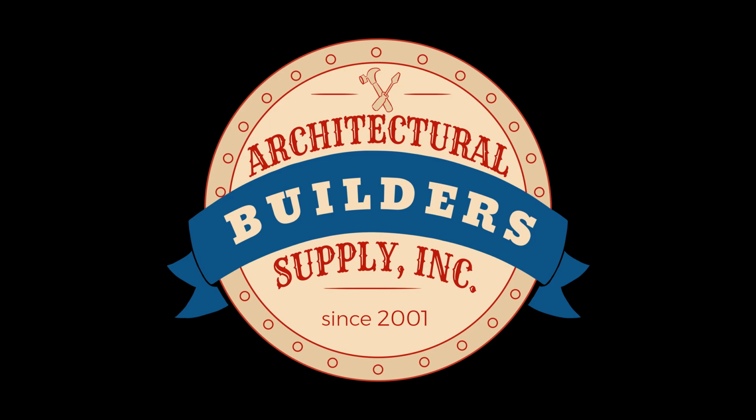So how many of these does Rixson make a month or a year? There's 6 of these on one job. It's unusual. So I need the guys to get it right when they go to install the material. I'm definitely going to print these 2 templates and set it in there. I'm glad you brought that up because that one line needs to stretch down to the solid line and not off that dotted line.